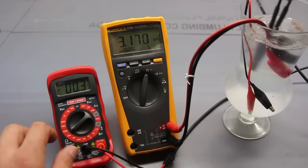The other thing is make sure your probes are also compatible to measure the amount of current, and they should be, if they're certified. The reading should say, so here it says Cat 3 1000 volt, but let me take a look on this cable. This cable says 2000 volts, 18 American wire gauge, can work up to 80 degrees Celsius. This one's right at Cat 3 1000 volt and at 10 amps. That should make sense, right? If the multimeter can take 10 amps, certainly you would expect the probes to. If it was any lower, you'd have incompatibility where this can measure more, but these won't.